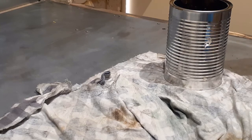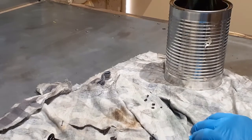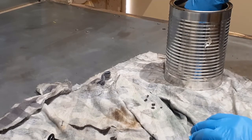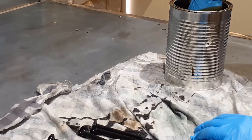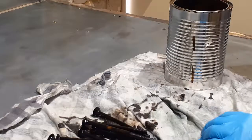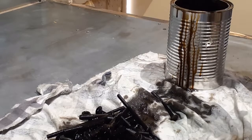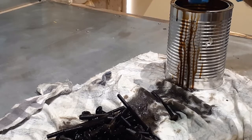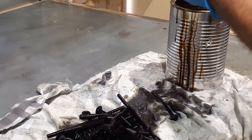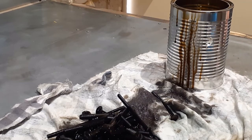Even though we got our metal probably a little bit too hot for this experiment, the results are actually looking quite good. You can use any sort of oil. We used a mineral-based old motor oil, which has got a high carbon content, and that probably accounts for why we're getting such a good dark finish on the metal. But you could use brand new oil or plant-based oils. I would probably suggest not using synthetic oils.